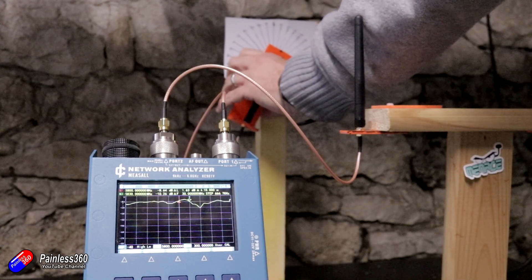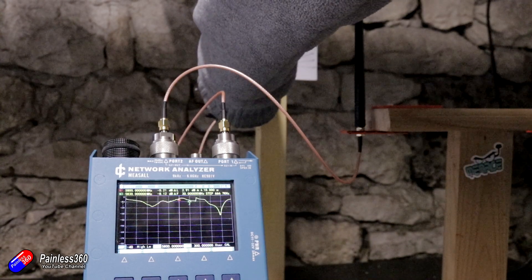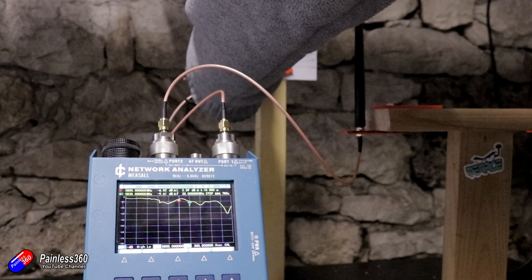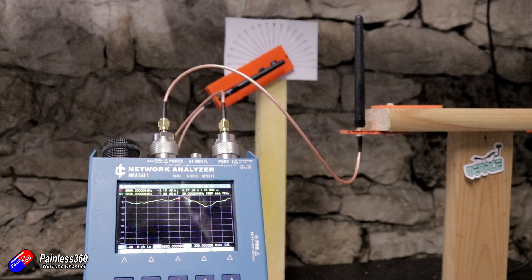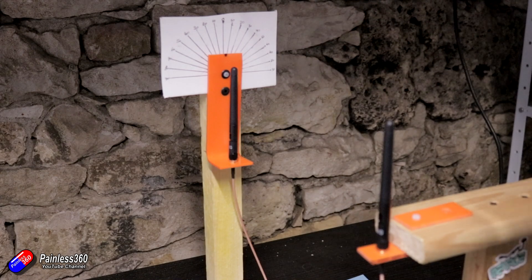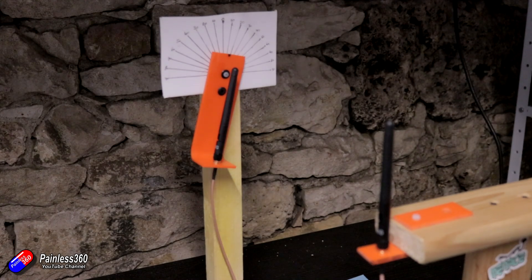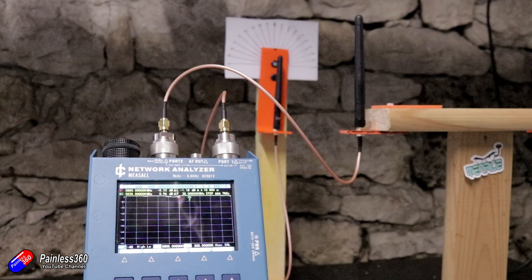So a big thank you to Menace RC, who built a rig to test this for both circular polarized and linear antennas - to see what the difference is when you move the antennas out of alignment. I'll put a link below for Menace RC; I use their antennas pretty much exclusively because they work really well. What Greg at Menace RC has done is created a little rig that rotates the active element around the axis, marked off in 10-degree increments. So we can start with the antennas perfectly aligned and then rotate them through 10-degree increments, measuring the impact on the received signal with his very high-end test equipment.